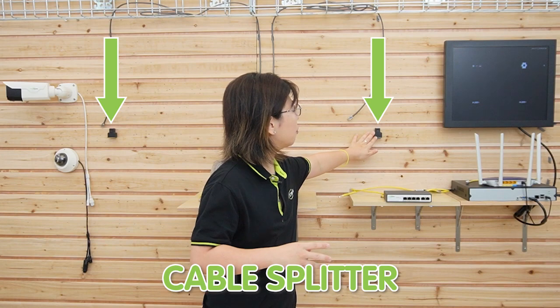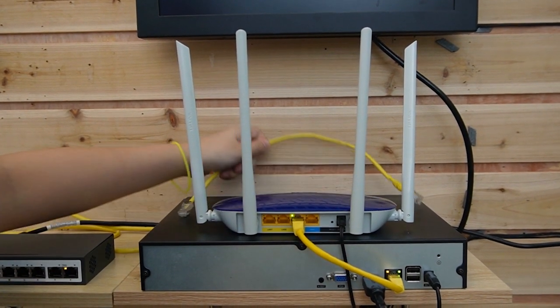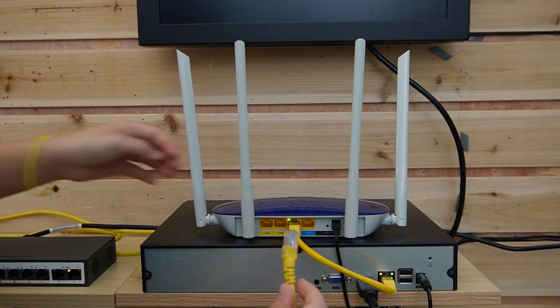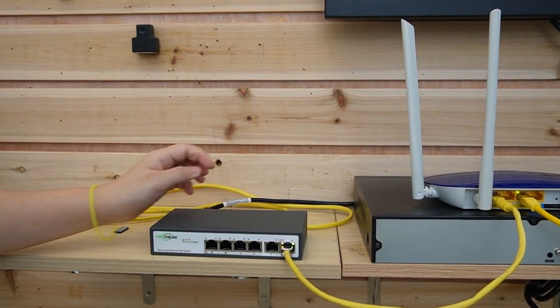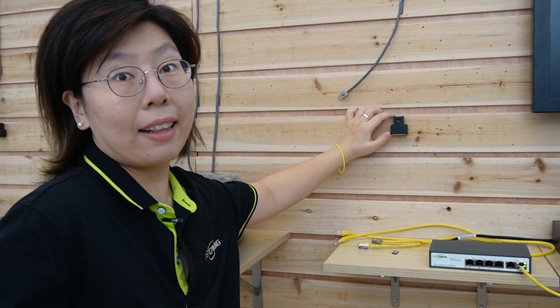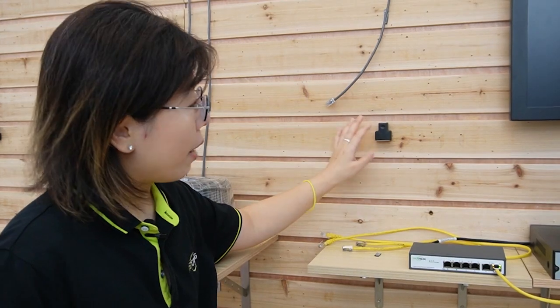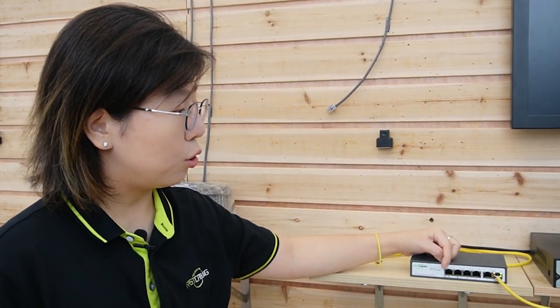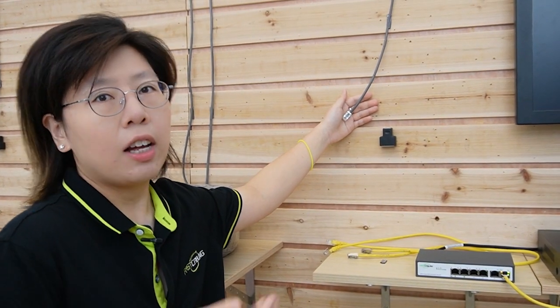Now I'm going to do the connection. As you can see, we have a PoE splitter on this side at the edge. First, I'm going to use a short patch cord to connect the router to the NVR. The NVR is already connected to the monitor to display video footage after we connect it to the IP cameras. Using another short patch cord to provide data for our long-range PoE switch. So why do we need to add the splitter? Remember, our customer can only use a single CAT6 Ethernet cable, so he cannot pull a new one for the IP cameras. That's why we need a splitter here to connect to two Ethernet cables to two PoE ports. This CAT6 Ethernet cable will use all four twisted pairs to send the signals.